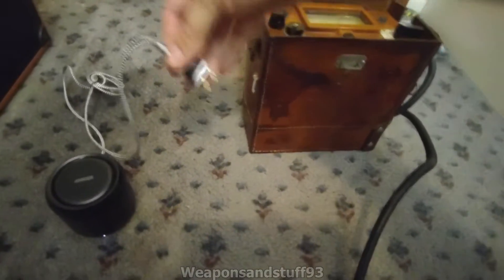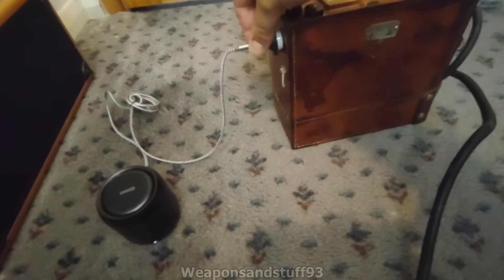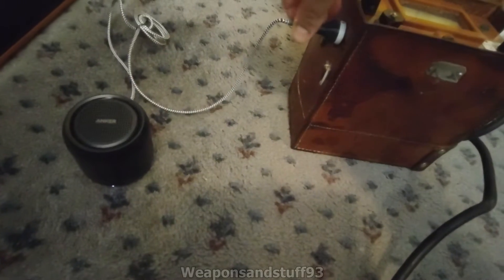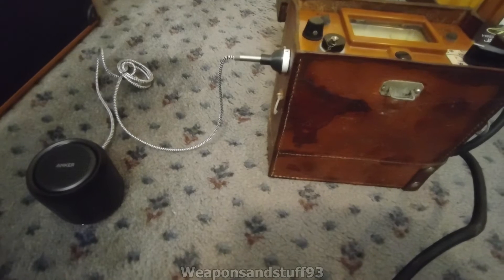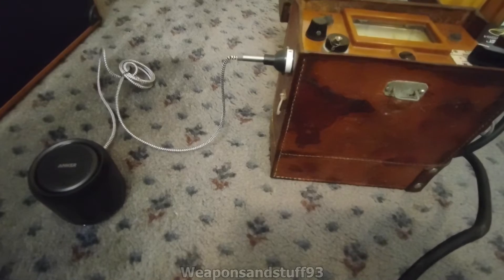All this is, is something that plugs into a DP-66 Polish Geiger counter from the Cold War. And then once that's in there, you plug it into any other auxiliary socket. The actual adapter is just literally two of those pins to a regular female auxiliary one — a bit like the ones they do for the CDV-700. And then you can get a Polish DP-66 Geiger counter to actually have a decent loudspeaker other people can hear.